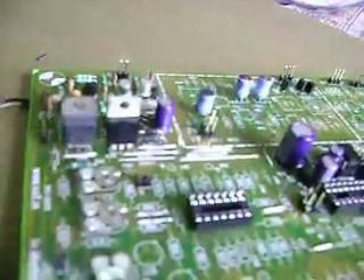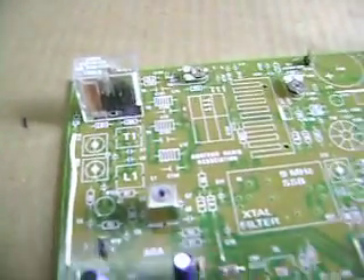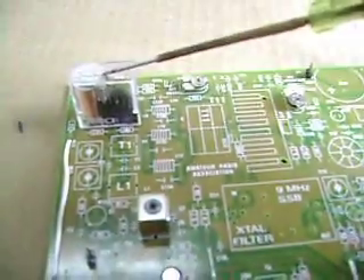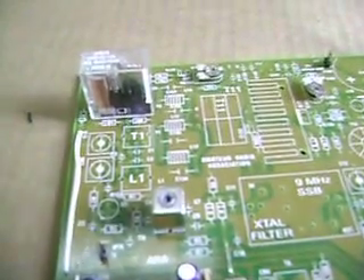Once this is done, just follow the track so that you give power to the relay, as it is sitting right on top of the board in the left corner. This is a relay for switching between RX and TX. Make sure you have put all the jumpers for connecting. When you press the PTT, this relay will get actuated and you will get that audible click sound — that kind of sound would come if your switching circuit is working properly.